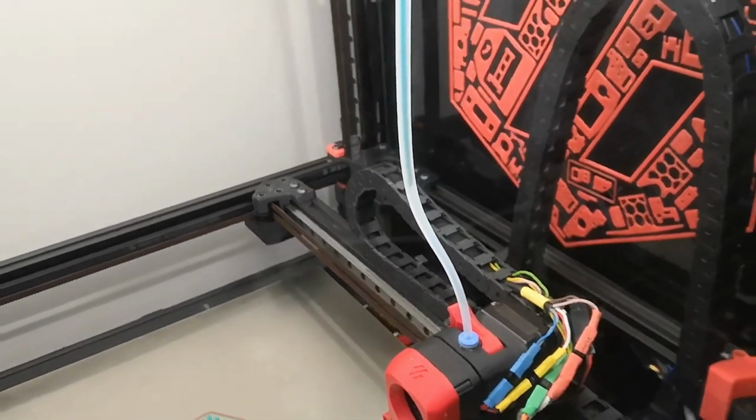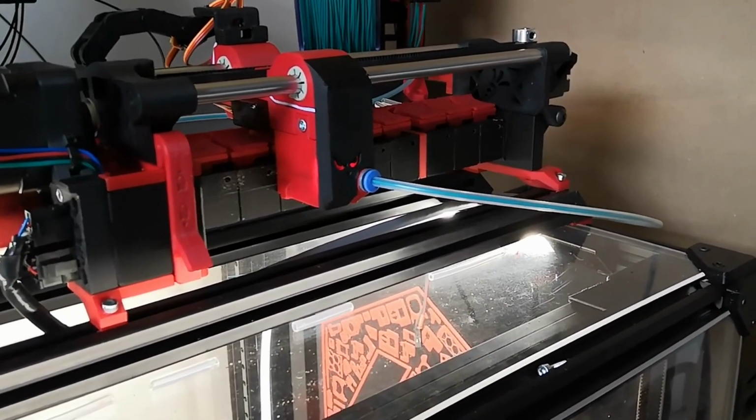So that it works every time. And I think you had dozens, hundreds of blocked nozzles because the cutting didn't work. Of course, because of the result, we changed the cutting mechanism. Because the cutting mechanism is also the most important thing, I think, in multicolor printing. And we have to do this inside of the tool head. Other brands cut it inside the filament unit, yes, I know. But we are compatible with different types of 3D printers. Because of that, we are cutting inside of the tool head.